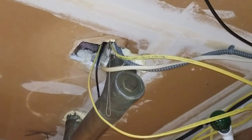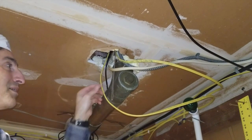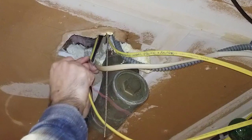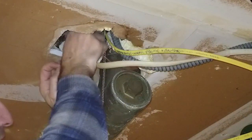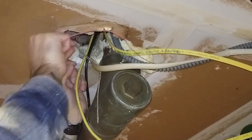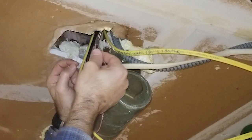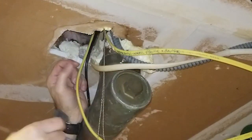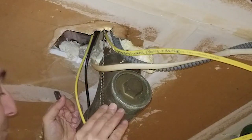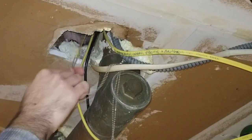Well, this was a pleasant surprise — the bead actually came through the opening, which means all I have to do is pull this and I've got the string. If it didn't come through, you'd go up into that pathway and gently try to snag it with the magnet and pull it down through the opening to get the same result. I got lucky here in that it had already fallen through. So now we pull — and there's our string.